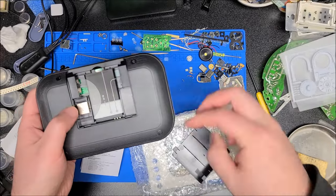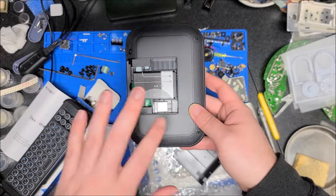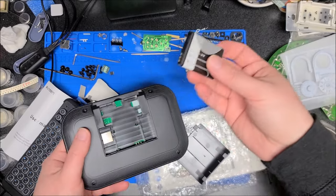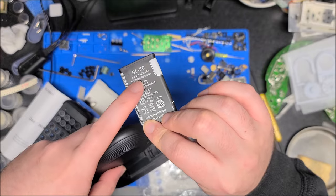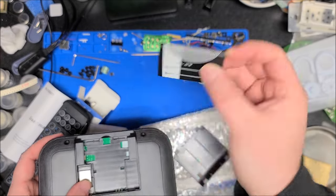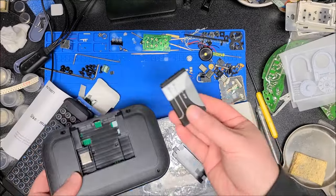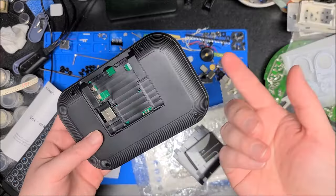We have a Nokia clone battery, the BL5C. That's a great thing about all of these — you can get these batteries super cheap and super easy. It says 1,020 milliamp hours — don't know if that's true — but a lot of times these remotes draw so little power that they don't need a super powerful battery and they seemingly run forever. I can already see contacts for a double-A battery option, though they didn't solder it and probably some components are missing.